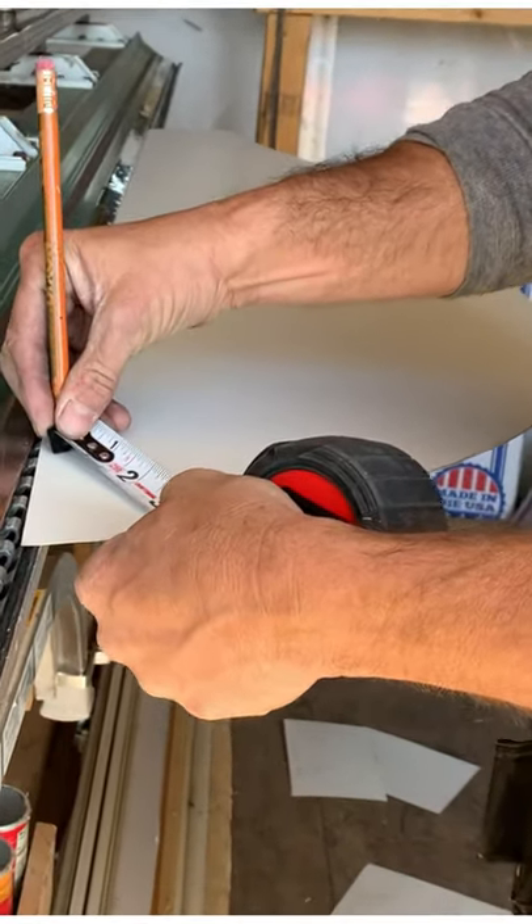I'm all about my metal being natural before I'm gluing and nailing. Now we're going to start putting these face pieces on — we're almost done. If you have a vinyl window you're going to install, it just becomes a lot easier because you can trace that round top on one big sheet of aluminum. Just make sure you leave yourself about 3-1/2 to 4 inches of space above your line when you trace a round top.